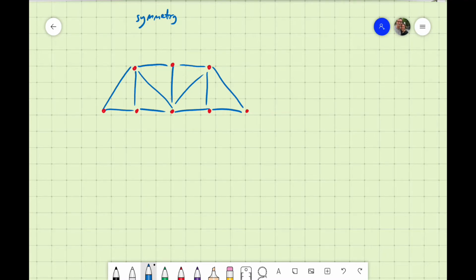All right, first thing he does, which is extremely wise, is he labels all the joints. So you should do the same thing. He works his way around the structure in some logical fashion. It doesn't matter what, as long as you pick it and stick to it. I will do exactly what he did. We have our dimensions: a 16-foot height, and 12-foot horizontal spans. If you do the Pythagorean theorem, you will see that the diagonals are all 20 feet. 12 squared plus 16 squared equals 20 squared. It wasn't directly given, but it's not too hard to work out.